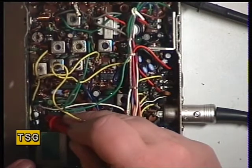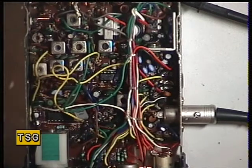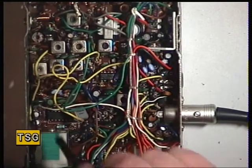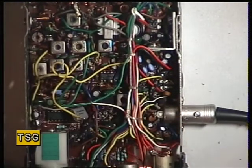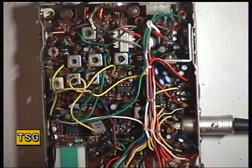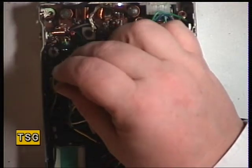That says test point just there. I presume that's how it's done. Anyway, it's never been touched on this. It's in lock. The VCO coil is clearly that one there. I can't tell you any coil numbers because it's too compact in the way it's screen printed — you can't see where the numbers are. It's quite clear to me that the first transmit coil is there.